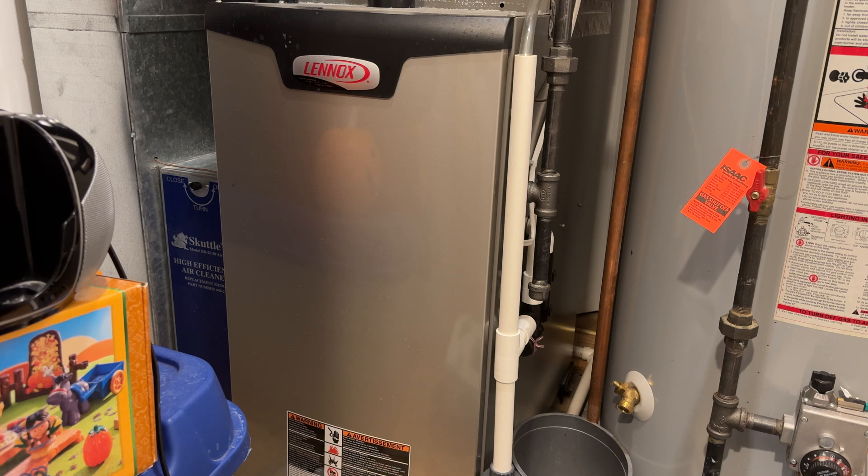Now I'll show you what it sounds like when it does a full cycle off. It will ramp the blower fan up to full speed and then drop it all the way off. Selecting off now. It has popped off — or at least the burner has kicked off. The draft inducer will still continue to run. The blower fan will speed up and the draft inducer will shut off. This is a very lengthy post-purge delay. The draft inducer slowed down even more. The blower fan just shut right off. I'll wait about a minute before I ask it to do a full call for heat.